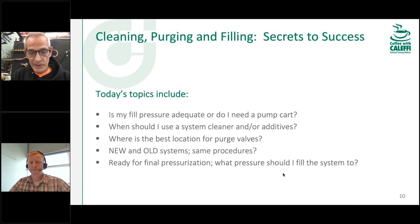This is a topic we've covered a few times over the years, but it's really important. What makes me want to revisit it is seeing questions on social media about starting up a heating system for the first time and having air problems or lockout problems. Most of the time those can be traced to air in the system that hasn't been properly removed — the right device wasn't used or the system wasn't purged — and others from dirt and corrosion from bad water.